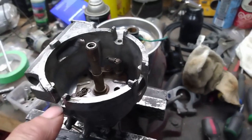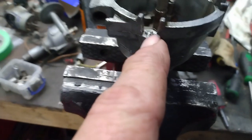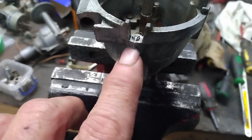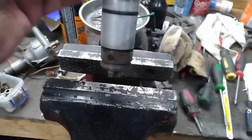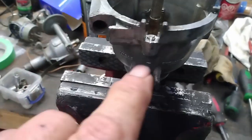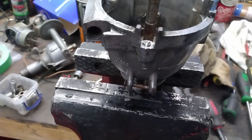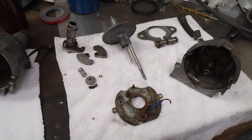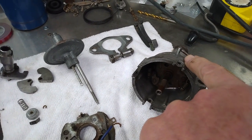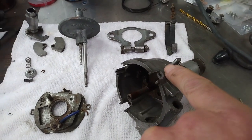I've got a lot of the cleaning done and I've managed to start the screw moving by cutting a slot and using a screwdriver to turn it. But in turning it, it's broken off the little tab. So I'm going to file this area flat, center punch it, and then drill it out, because it goes all the way through. I'm hoping the drill catches and spins what's left of the screw out the bottom. However, when I went to enlarge the hole with a larger drill bit, that bit broke — so now I have a piece of drill bit stuck inside.